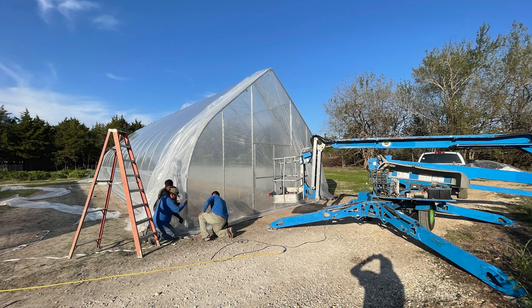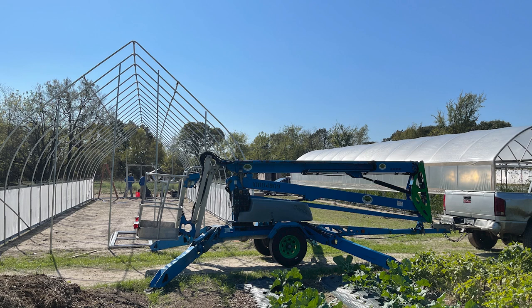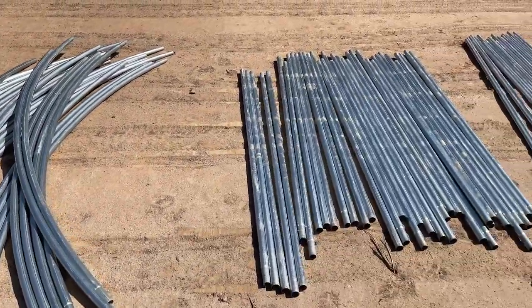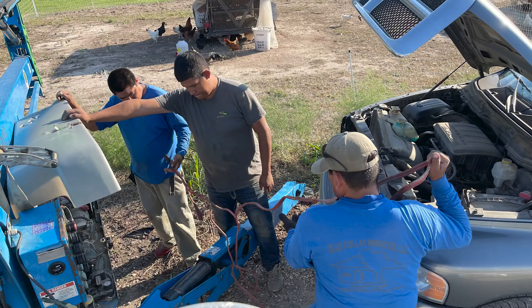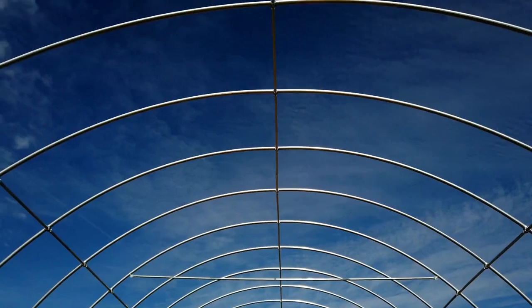Back to dealing with the rental company: find one that has the type of equipment you need and understand the terms — whether it's by the day or by the hour. Renting over a weekend can sometimes get you cheaper rates. Even on a 100-foot structure, if you're prepared and the weather's good, two days can be plenty. Budget for battery recharging — a lot of these run on electric hydraulics. Plan to charge the battery at lunch and at end of day.